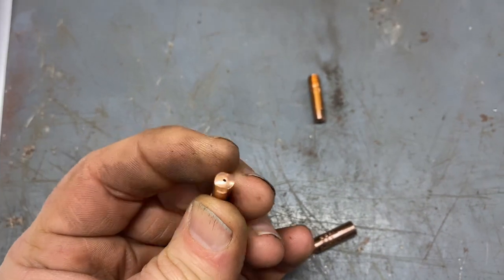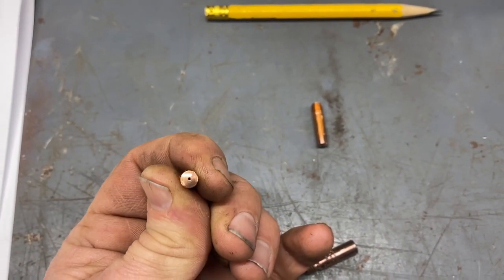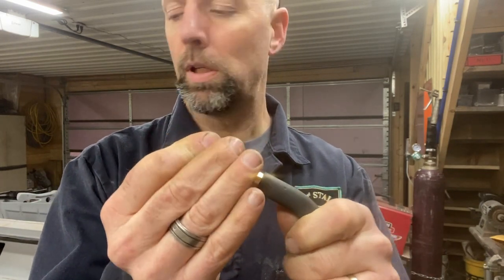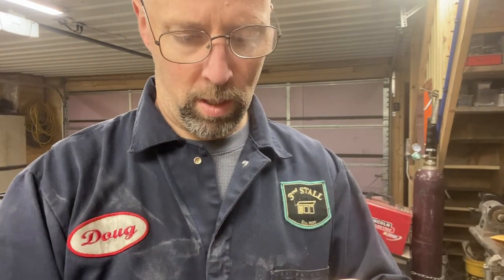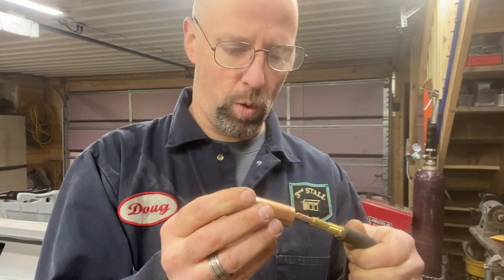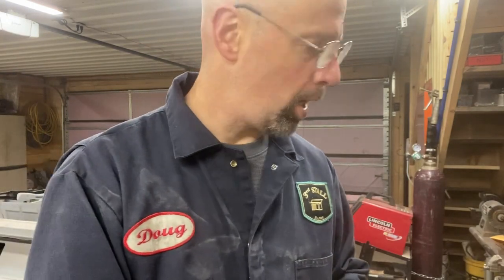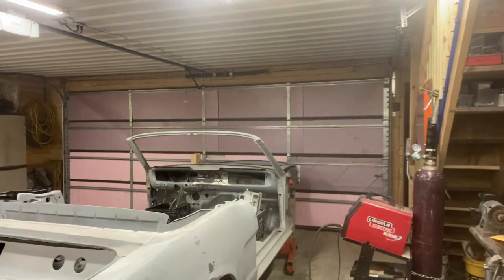So I'm gonna put that on my welder, and hopefully that helps, gives me better control of the wire, and better electrical contact and less moving around. And so we'll make that change next. So the brand new, correctly sized welding tip goes on. I'm gonna just snug it up, not too tightly, just lightly snug it up. And I have my slightly shortened copper shield that goes on there. And that should be better. All right, let's see what's next. That was tip number 3.